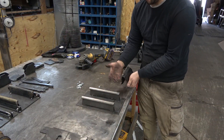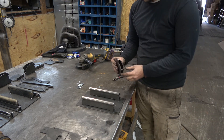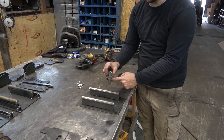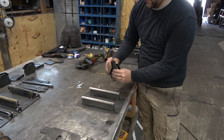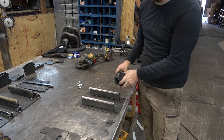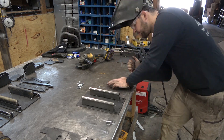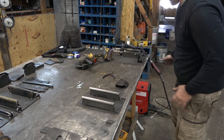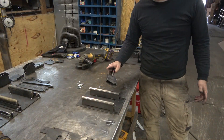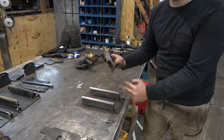So that angle is locked up pretty well now. With those two tacks in to lock everything into a real nice 90, you want these two parallel — 90 degrees, 90 degrees. Now adjust as you see fit. Mine's pretty much right there. We're going to use the tongue to lock that down — bend it to whatever angle it needs to be. Feel free to just hit it. That's where I like it. We're going to weld that out. This is one of the few pieces we're actually going to weld out early in the process. Everything else gets welded once your fitment's perfect, but this guy — as long as those two are parallel, you're good.